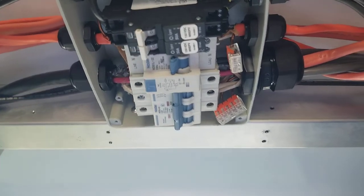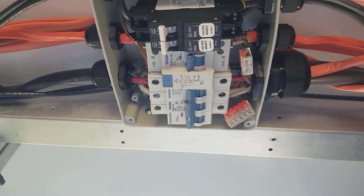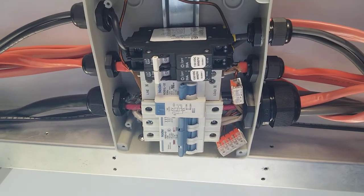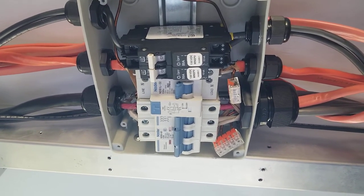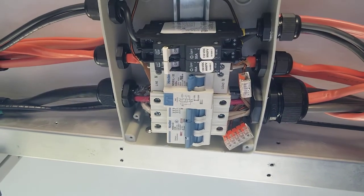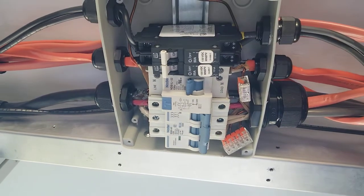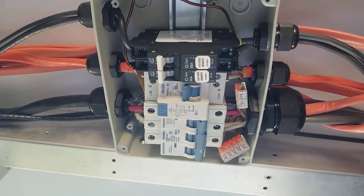So the purpose of this right here is pretty much just to protect the UPS units as well as the automatic transfer switch there, as well as we just want to make sure that there's an additional breaker other than what we have on the device, and we have this outside. This also makes it very easy to just kind of turn off the power input. Like, I can do it right now, but because we're not hooked up to shore generator power, absolutely nothing happened.